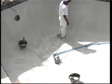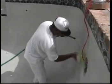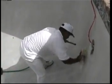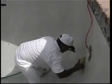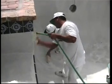Keep a sump pump running in the main drain at all times to discharge the wash solution. Dispose of wash as directed by local codes and requirements. Avoid leaving hoses, buckets, or any other items on the Diamond Brite surface during exposure, as this will result in visual blemishes.